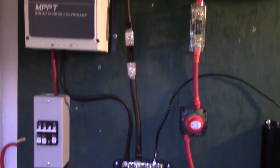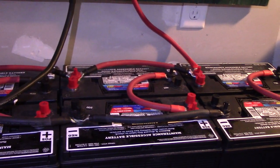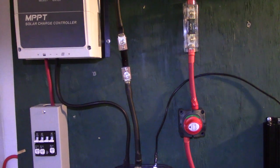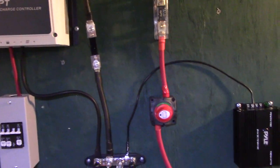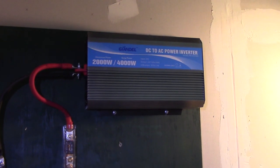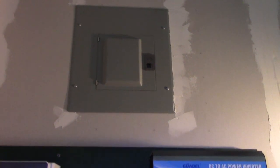It's a lot of work but it's relatively simple, and I think this will work for me. I'm hoping if I've done something wrong, one of you smart people will tell me. When I set up the meters, fuse block, and panels I should dig my trench this week and run all my conduit to set up the panels — that'll be next week's video. I'll come out of the inverter into that service panel on a 30-amp breaker, and it'll power the cabin from these batteries instead of the generator.